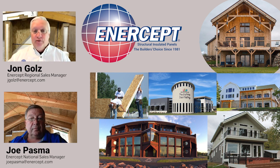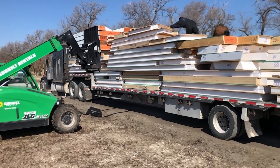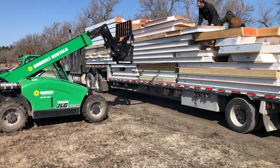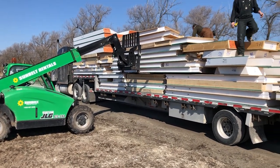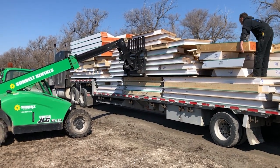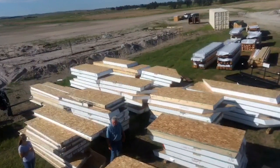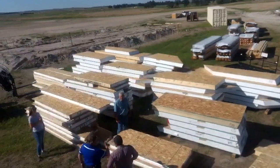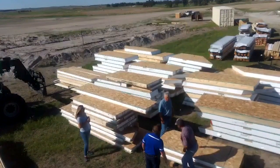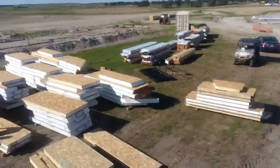Now you've gone through that process — maybe you're in a situation where it's worth paying extra for an additional truck or to have it loaded with dunnage. Either way, the truck gets there and you need to stage the panels. There are a variety of different challenges: lot size, how much room you have, whether the floor deck is already built. The truckers — we use independent truckers — generally allow about two hours to offload the material. So you really have to have a spot set up where you can just get the material off the truck, then move it around and stage it in a way that makes sense for how you're going to put the panels up.